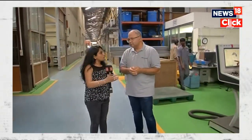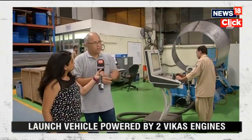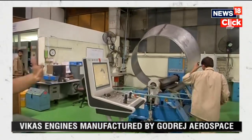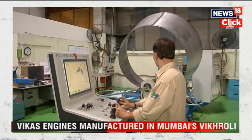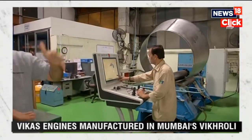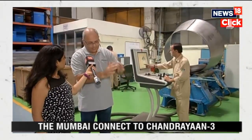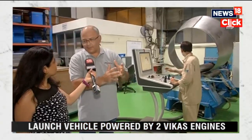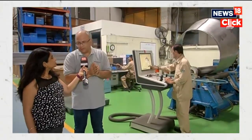On our left and right we can see sheets being cut and shaped. To explain for our viewers: there is a machine called a laser cutter where the sheet is cut into shape, then rolled over a CNC rolling machine to take its form. After the roll is completed, seam welding is done — as you can see on the right-hand side. Similarly, other stages of the cone are prepared and welded one over the other. Finally, there is an expander which creates the proper shape, ensuring correct flow of exhaust gases. The whole design worked out by ISRO is taking shape here at Godrej.